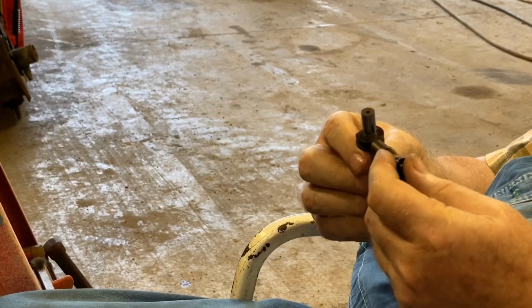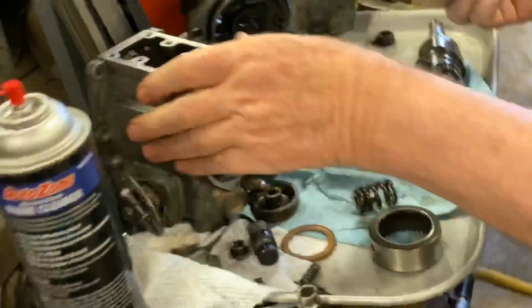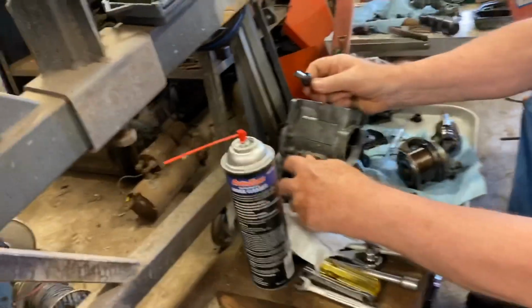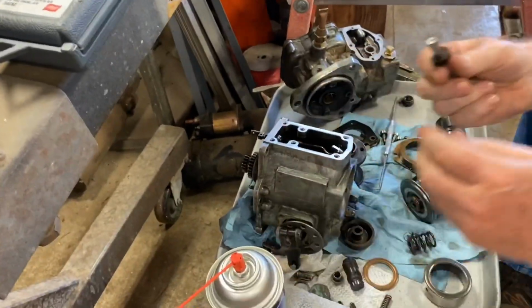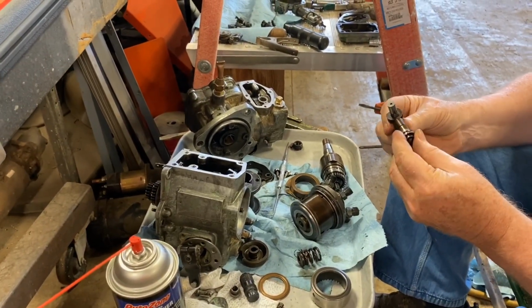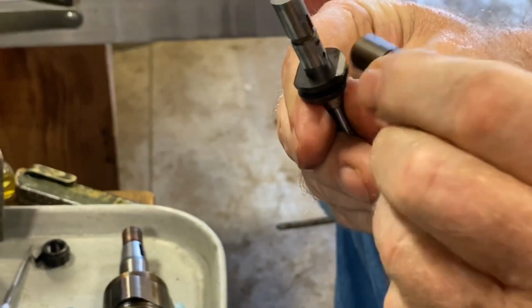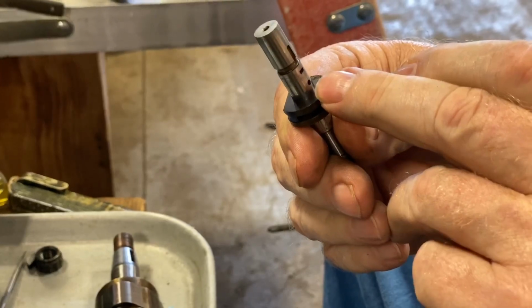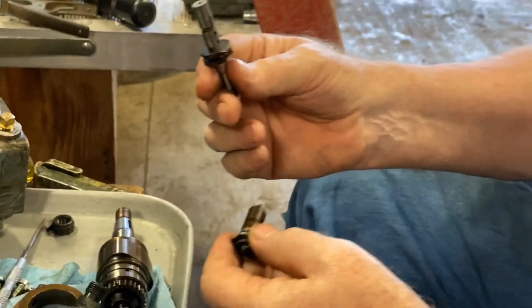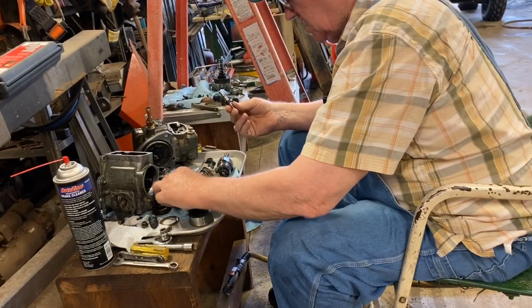And when you shut the engine off, the lever right here, when you pull back on the shutoff lever, it pulls back on this clockwise and brings this down below that hole right there, and it stops because you can't build pressure. That's basically it in a nutshell.